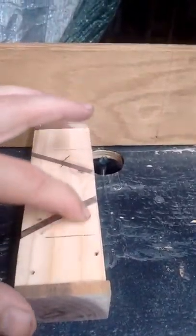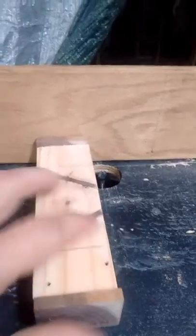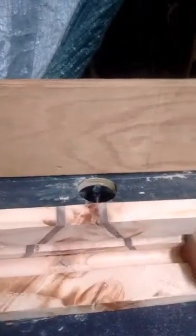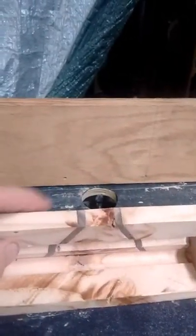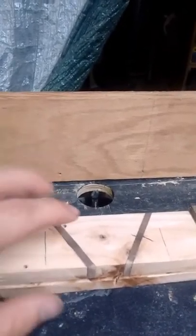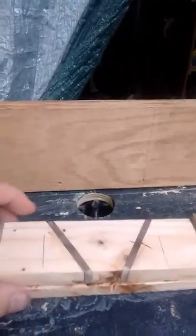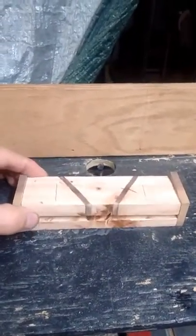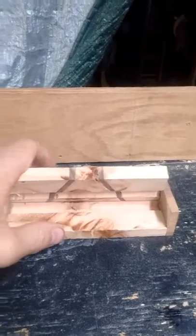One of the things I ended up doing with this box is I'm going to basically set it up lengthwise and cut along the front on my table saw and then clean up the cut afterwards. I'll hit all this with some sandpaper, sand it down probably to about 600 grit, and then probably hit it with some polyurethane. I'll use this to show off the pen boxes.